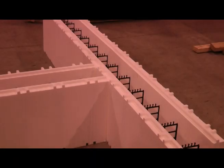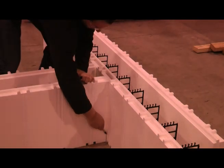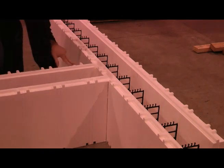Working from the corners to the middle of the wall, build the through wall as you would normally. With your felt marker, mark the through wall where your perpendicular wall will intersect.